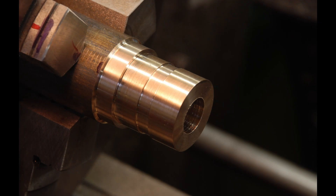I want to prepare the headstock inboard bearing — the double taper one — and what I chose to use was a nice big piece of bearing bronze. A number of thoughts went into that as opposed to trying to make one out of hardened steel like the original. First of all, many of the Schaublin 70s did have bronze headstock bearings, so it's not like it's an inappropriate way to approach it or that it won't last. Kept oiled it should last indefinitely, and the other reason was to get a really great fit on the double taper mating. I thought I'd probably have to end up relying on scraping for part of the fitting process, something that would be impossible to do with hardened steel.